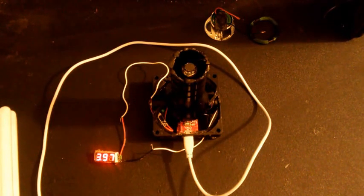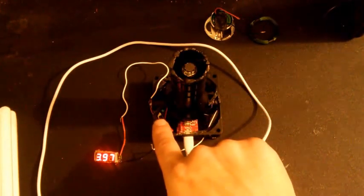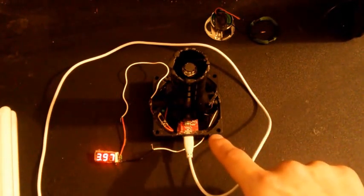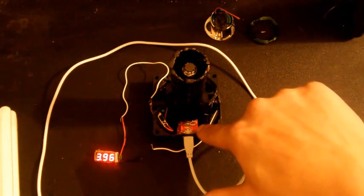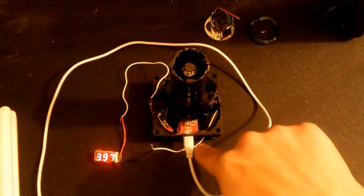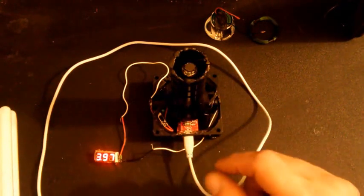I've made a couple videos about this, but I'm trying to recommend more people do this for their slayer exciters. Essentially just use a 3.7 volt — which is about a nominal 4.2 volt cell, sitting at about 4 volts now — one of those rechargeable lithium cells. You can find those in cheap USB power banks for less than five dollars, inside of which there will also be a charging circuit. That little charging circuit hooked to the cell is what boosts the voltage to give a USB 5-volt output, and likewise it'll take a USB input to charge the cell and stop once it reaches about 4.2 volts.